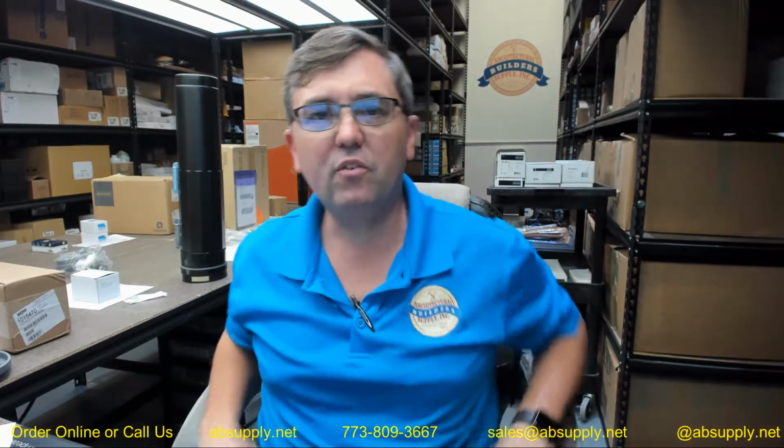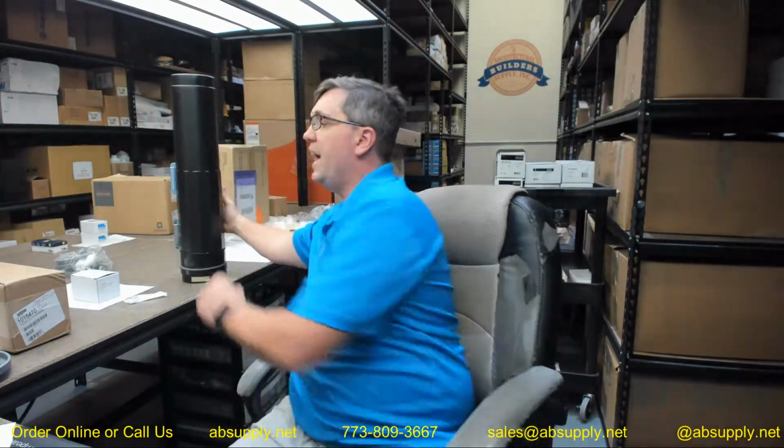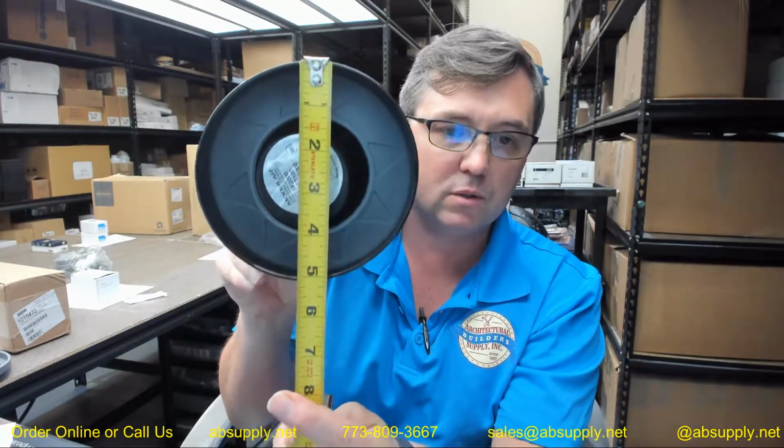Now, according to the manufacturer, the size of the hole that you need to install this is 5.5 inch. A little bit of a reality check we'll do on that. Yeah, that would be certainly adequate. This model, now, keep in mind, it's really going to be for an under counter mount or an on the wall mount. So the OD of the clamp ring is about 5 1/8. So 5.5 inch is going to work.